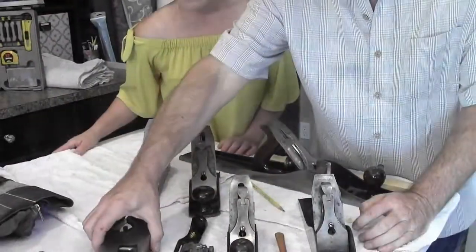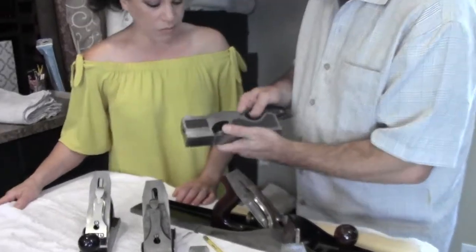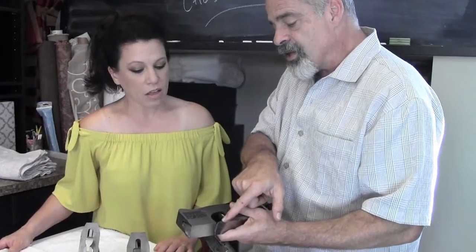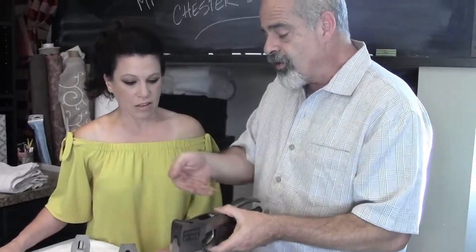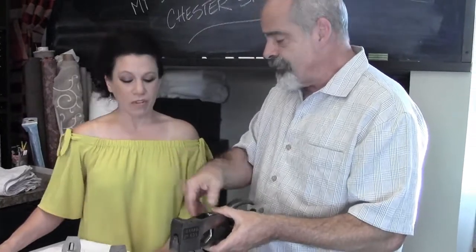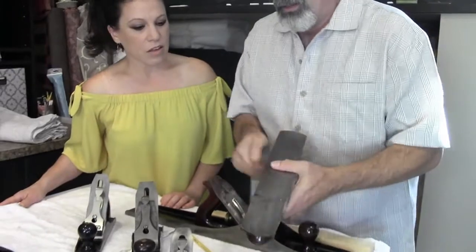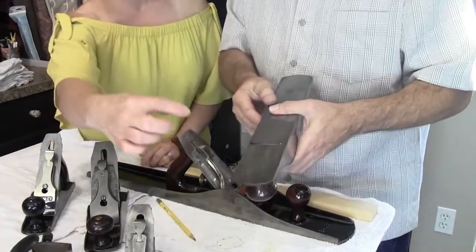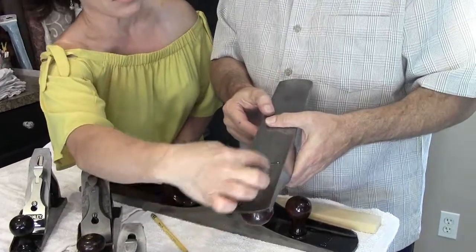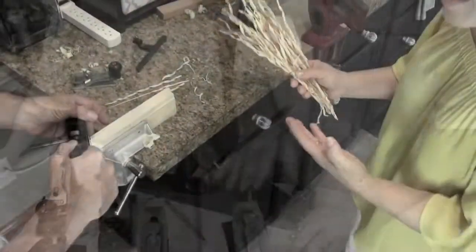On this one, you see right through the side, there's a blade all the way to the edge. Right. This is called a rabbet plane. Because the blade comes all the way to the side, I'll show you on the piece of wood over there, I can cut all the way up against another shoulder. Perfect. Which I can't do with this one because this blade is that far away from that shoulder. So in other words, a piece of wood would have to be in the center of this in order to catch the whole thing. Right, yeah. Exactly. Okay, this is just amazing.